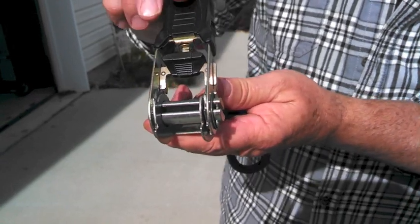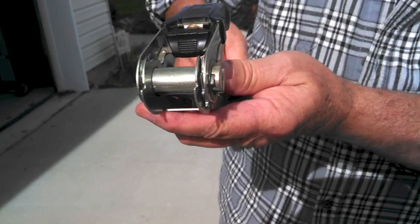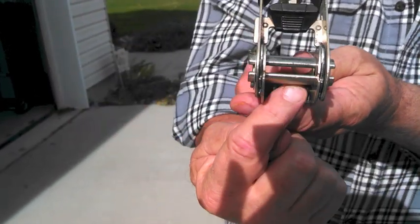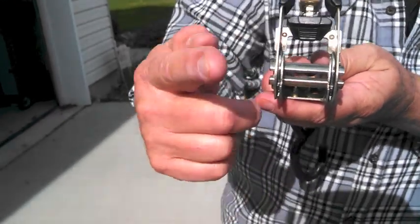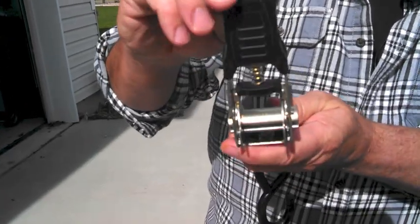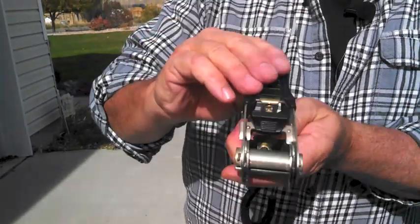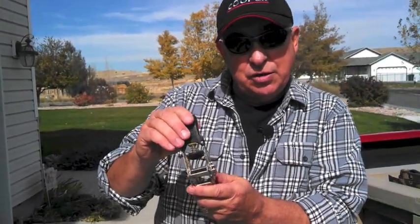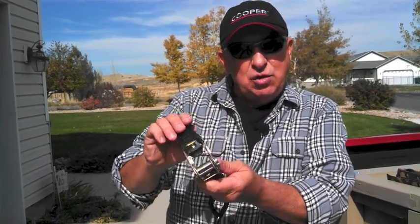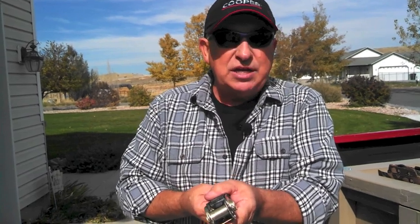Notice that this rod through here is slotted — you can see that right there. That is where your strap is going to go. You're going to put the strap through that slot back towards the direction of the attachment. After just a few rotations, the tail of the strap gets wrapped up and causes it to tension so you can really tension down the load.